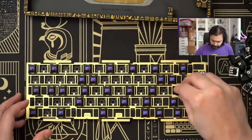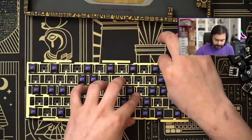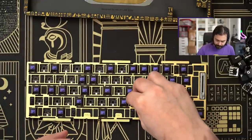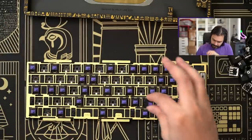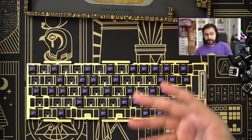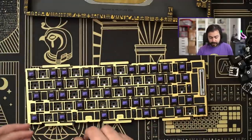As long as a full plate is offered, and it's made by the same manufacturer that does this plate, I assume the tolerances are going to be just as tight, which means your switches are going to clip in just fine. Normally, I'm afraid when it comes to hot swap builds and hot swap PCBs. Look at something like the Sandglass Ergo, where the plate was incapable of holding the switches in place, which meant if you were trying to take your caps off, you ended up taking your switch out. And if your switch is that easy to take out, that means it's not firmly in place,